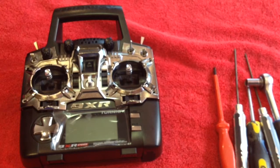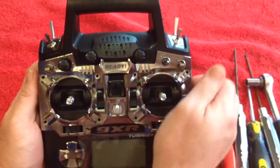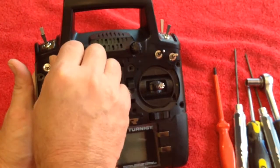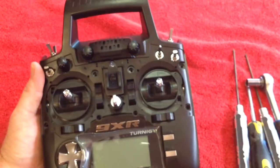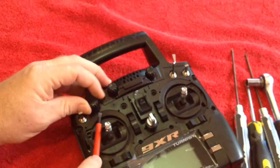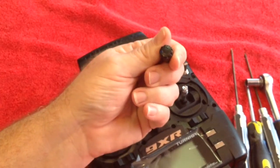First thing you need to do is remove the face plate from your 9XR. Remove these Allen hex bolts there, which I have already done to make this video a little bit quicker. Once you have unscrewed those, put your face plate aside. Now as according to the instructions, you want to remove this knob. Get a flat bladed screwdriver, gently get in underneath here, rotate round and just lift off that knob. There we go — not too hard.